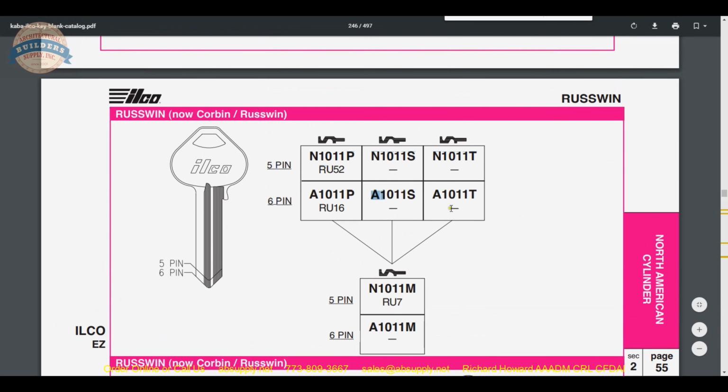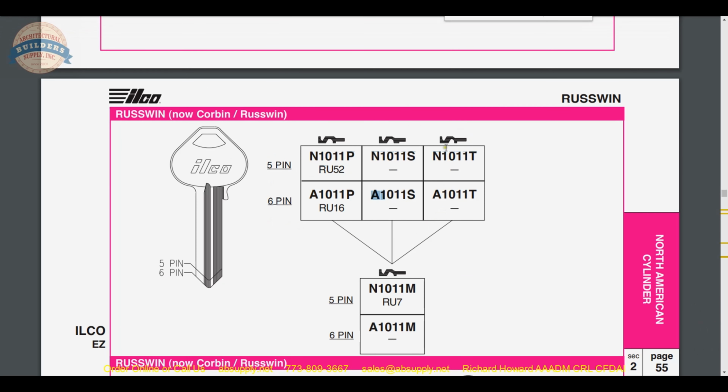So the 981 class is a family of three keyways that operated in a multiplex structure with an all-section key blank that could be used to pass these. So these here would be key blanks and cylinders. This would be a key blank only. An application of how you could leverage a multiplex system would be very simply stated.